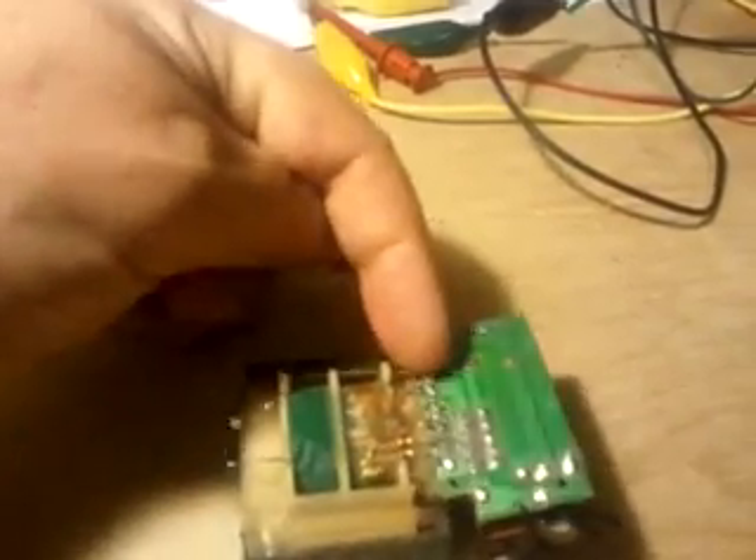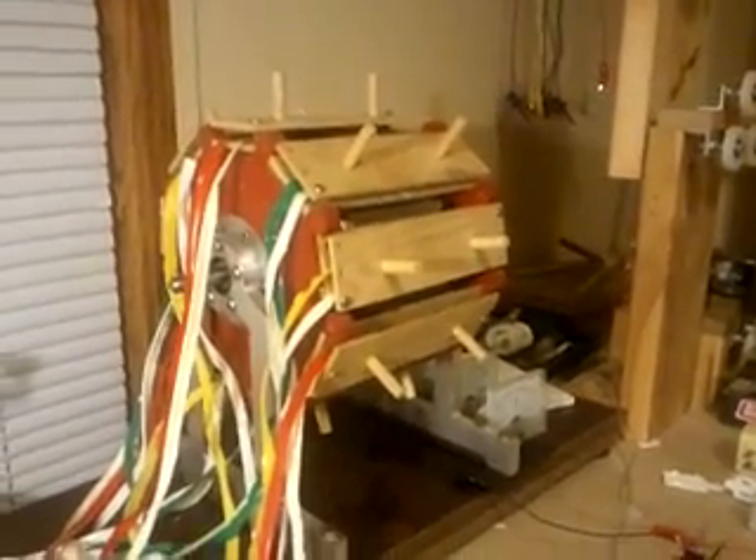Not the output of this - there's no electrical connection to do that. There's no electrical connection between here and here. It is only because we are turning the circuit on and off - whichever circuit you use. You can use a Bedini circuit, reed switches, hall sensors, brushes, solid state - it doesn't matter. As long as you make a pulse, that's all you need to do. Now the crisper you shut the pulse off, the better the spike is going to be. A crisp disconnect of the coil will give you a better back spike.